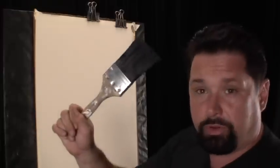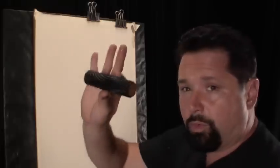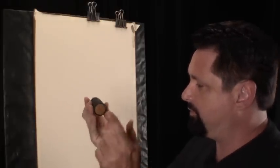I don't switch brushes between oil, water, and all this other stuff. I like them to keep their shape. When you put them in all these other products, start using different things to clean them up with, it loses its shape. Black nylon bristle brush, this one is the Purdy Peacock. Then of course we're going to need our coarse rocker grainer. This is a 4-inch coarse rocker grainer, rubber with the insert.